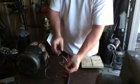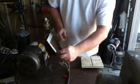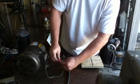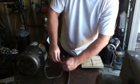Now this is more or less the three-phase circuit here. Now we're going to add the pony motor to this circuit. We're going to take our ground wire, go ahead and hook up our ground wire. We're going to put a wire nut so all three of these green wires are hooked up together.